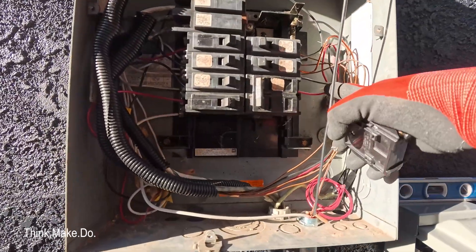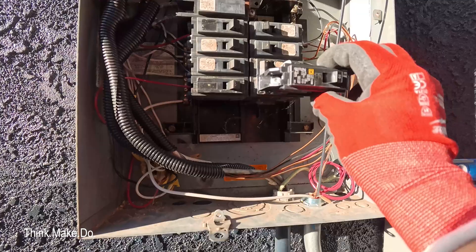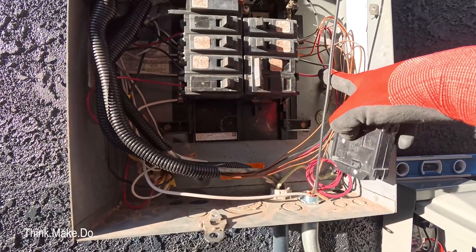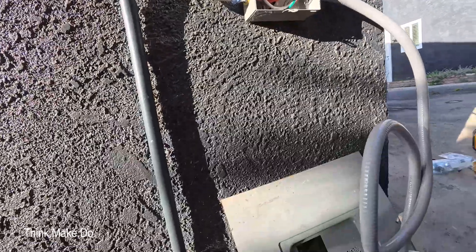What we need to do right now is take this off. I've got two 20-amp breakers; we're going to stick them on here. One is going to plug back into this existing circuit, and one is going to plug into my black wire that goes to my box here, which is going to give me power to my whip. And that should be about it. Let's do it.